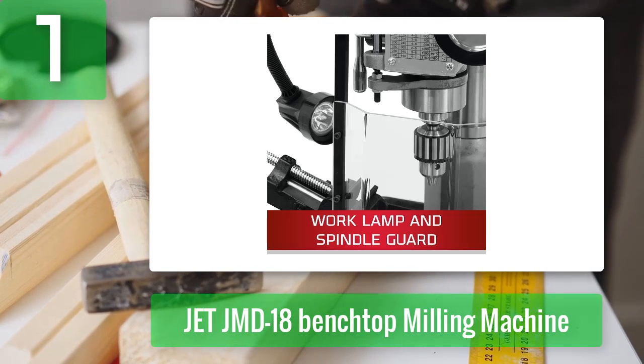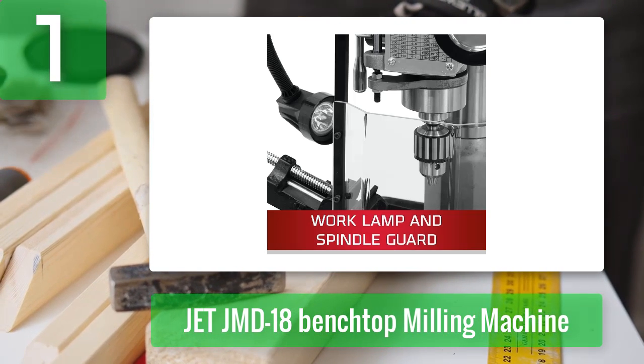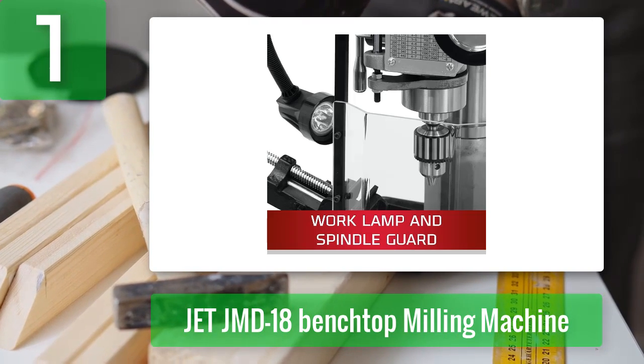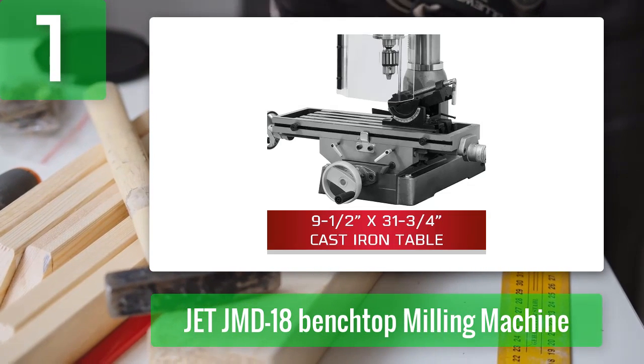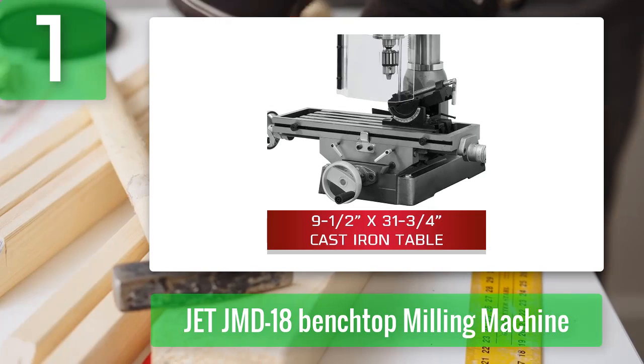It doesn't matter whether you are working with wood, aluminum, or ceramic tile, you are going to get excellent and impeccable results. It has a drilling capacity of 1.25 inches with an end milling capacity of 0.75 inches. You also get the capability of face milling with this benchtop milling machine.